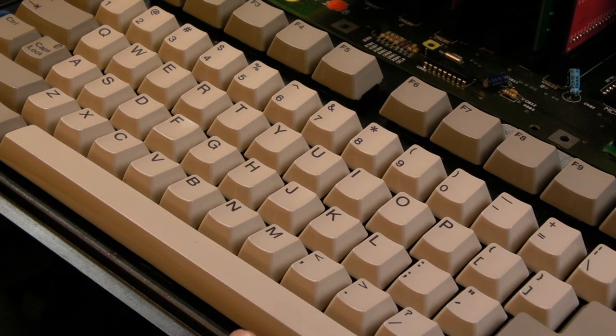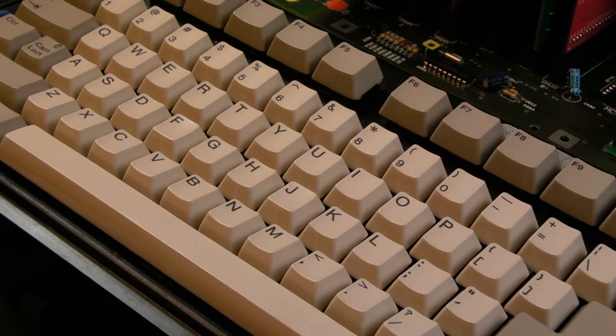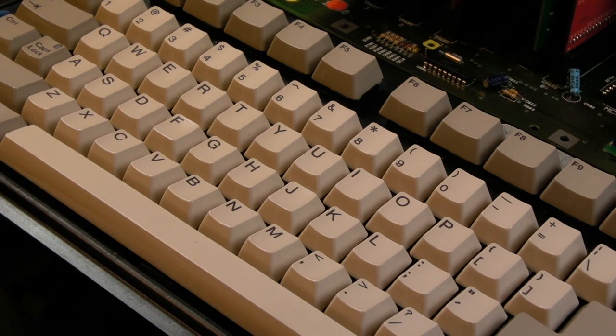And coming back to keycaps again, as you saw in the recent C64 video where I did the clear keycaps and they all cracked on the bottom row, that guy really, really annoyed me with his, oh well, everybody knows this, not to use IPA on plastics. That is absolute rubbish. It's the fact that those keycaps are clear, transparent, they've got acrylic mixed with them. Acrylic, you stay away from acrylic. So you could argue that I should have known that, but I've never learned that in my 30 years of working on systems and things.